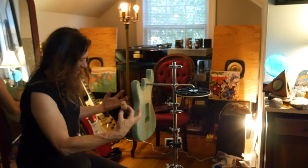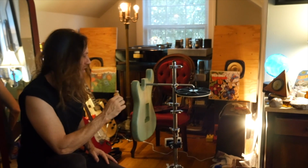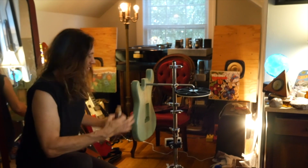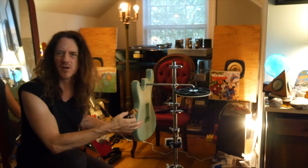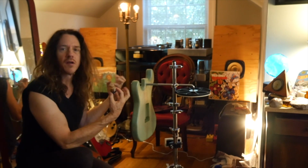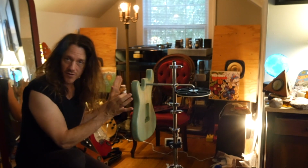Now, this piece of wood sucked up the stain and the top gloss. Another piece of wood, like this one, didn't suck it up nearly as much. It had a sealed feel. This one, even though it was sanded the same amount to the same grit, because it's Paulownia or whatever the wood is, candlenut wood, Paulownia, maybe poplar, it's a little more porous, and it took a little more to get good coverage.